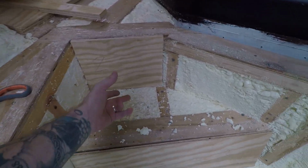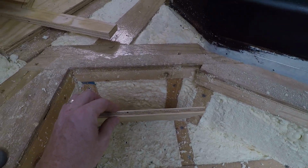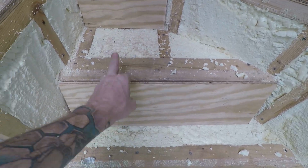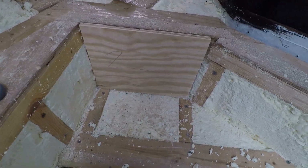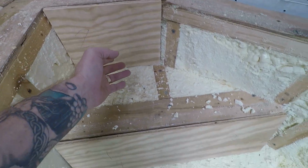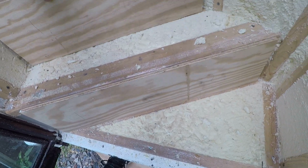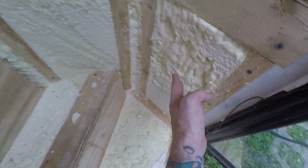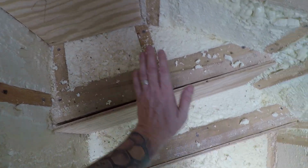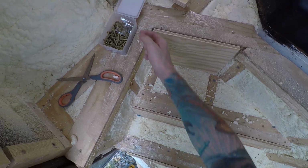And now I'm putting plywood on the stairs, but I'm using 1/2-inch plywood there. I don't need to use 3/4 inch, it's too thick and just gonna raise everything and make everything smaller. So 1/2-inch plywood is good enough, and I'm doing these vertical pieces first, you see, those, and then I'm gonna do, of course, all on the side as well, and then I'm gonna add the horizontal pieces after that. I'm just cutting them with a jigsaw, really.